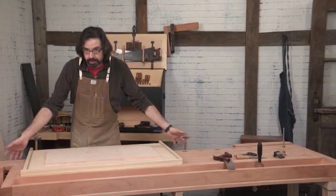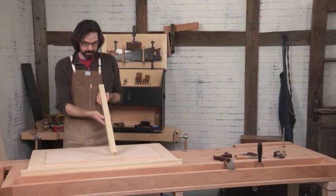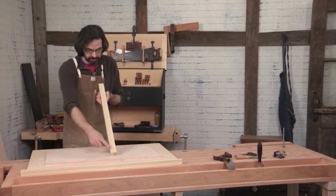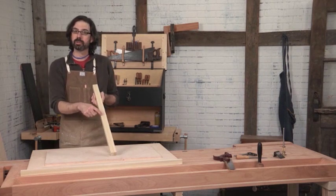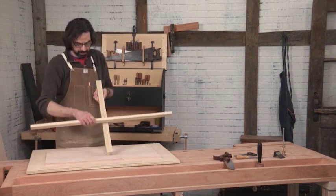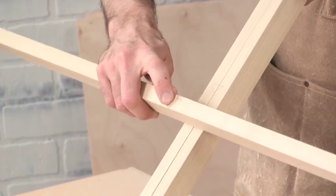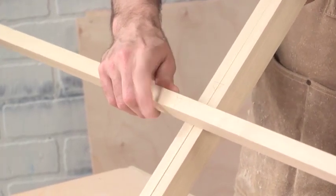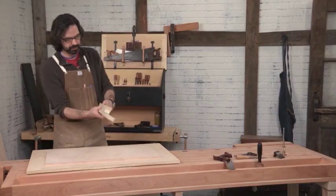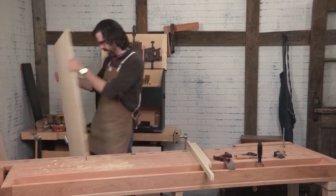And so the first thing to do, when you're going to do a construction, is you're going to want to put a cabinet maker's triangle on the top surface that shows which way is front, so you can always know which way is left and which way is right, because you don't want to get these guys turned around. And also so that you keep that front part of the dust seal orientated correctly, I've put a little cabinet maker's triangle there too, and that will guide me through the whole dovetail process. So I'm going to put the lid aside to clear the bench,